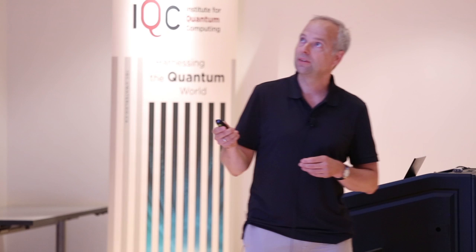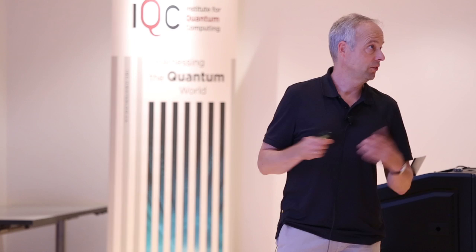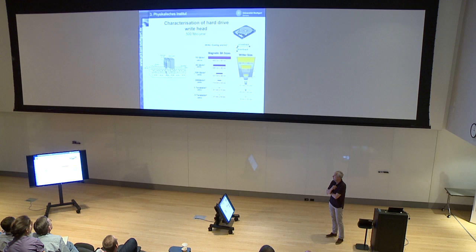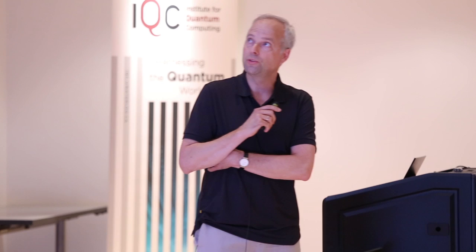As you probably know, in your hard drive there are three main parts: the recording medium, a reader which reads the magnetization in that medium, and a write pole which magnetizes your recording medium — that is, which writes information into it. In current devices, these write heads have characteristic dimensions somewhere between 100 nanometers and a bit smaller. The magnetic recording industry has set out a timeline for reducing that size from around 100 nanometers towards 20 nanometers.